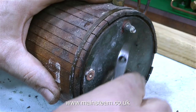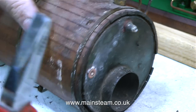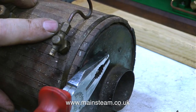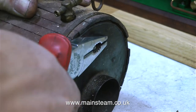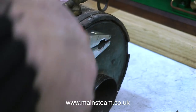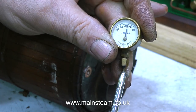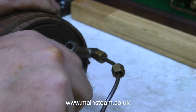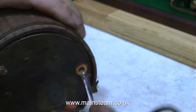The brass has got really brittle. The best material for fittings has always been phosphor bronze, but most of the time it's brass — and to be fair, they last about 50 years, so really what's the point in making them expensive out of phosphor bronze when brass does the job for quite a long time? The pressure gauge checks out perfectly — it's a Basset Lowke pressure gauge. Basset Lowke made really good quality equipment in the day, and this pressure gauge is perfectly fine to be used on another boiler. I'm just removing the clack valve, and the boiler's almost full of water.